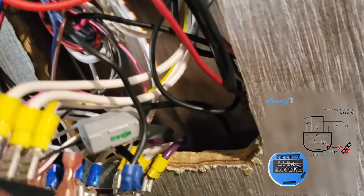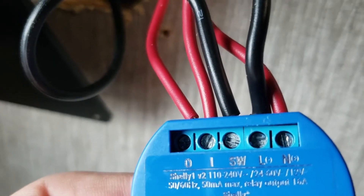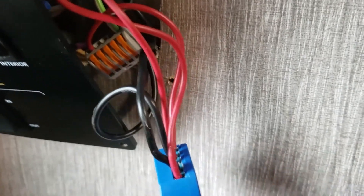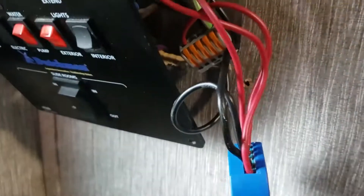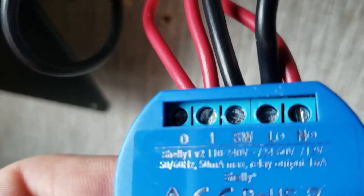This wiring diagram shows you how to set up the wires for a 12 volt system. The power coming into the switch on the bottom is positive, and the wire going on the top of the switch is going to the lights, or what is called the load in my setup. The top wire will connect to O, or the output, on the Shelly. You're going to have to find a negative lead in your wall somewhere, but make sure you be careful because there is also 120 volt AC wire in the wall too, and it can be very dangerous.